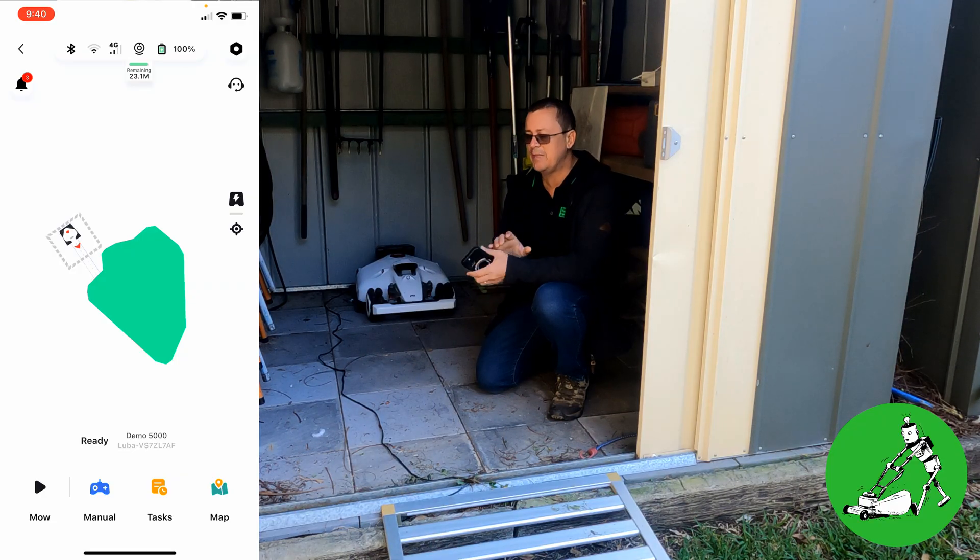With the issue of the camera meterage not coming up: if anyone has more of an idea than I do about what situation causes that or can replicate it, please put a comment below. I've tried to replicate it four or five different ways and have not been able to. I'm quite convinced it has something to do with the correction data coming from the RTK base station — specifically that correction data being significantly different between when it docked and when it wants to go out. But the reason why the camera meterage shuts off and doesn't come back is a bit of a mystery to me.